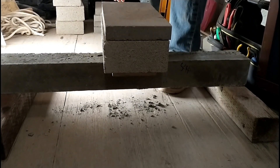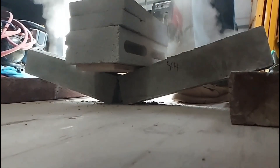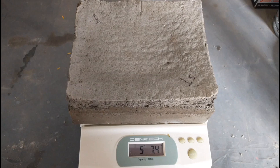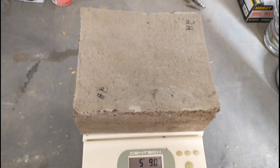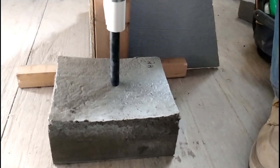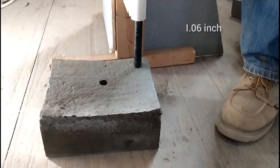I'm adding bricks slowly, hoping this one would do better. It did not — it held about as much as the last couple of batches. As you can see, there are some pretty big air bubbles through it; all of these batches had pretty big air bubbles throughout. Here we're getting set up for the drop test. The overall weight on these was a little lighter — about five and a half pounds compared to more like six and a half pounds from our previous test batch. In the drop test, they all performed pretty close to the same, about 15% worse than our original test samples.